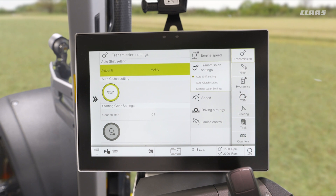It's an on or off value, so no other settings in relation to it. With the feature turned on, if I press my foot on the brake it will also engage the clutch. For example, with a round baler and wrapper, I need to eject the bale out of the back of the baler once it's been wrapped. I can just apply my foot onto the brake pedal — it will disengage drive to the machine. I can eject my bale, take my foot back off the brake pedal, and it will re-engage drive for me. So a nice simple setting to work in the background.